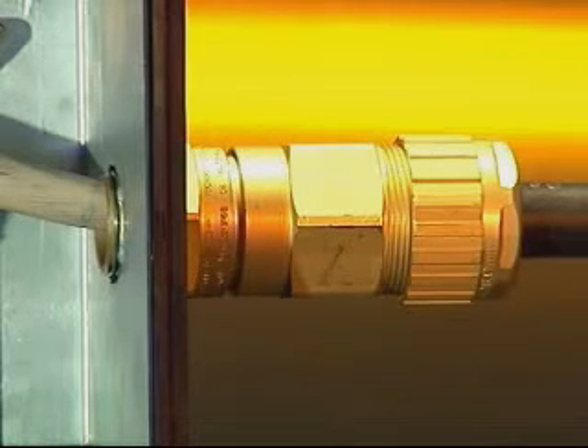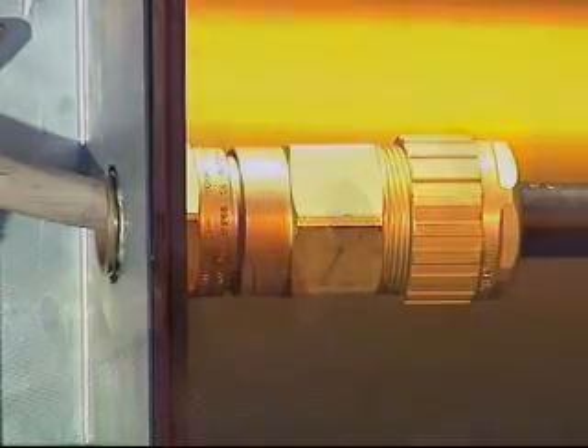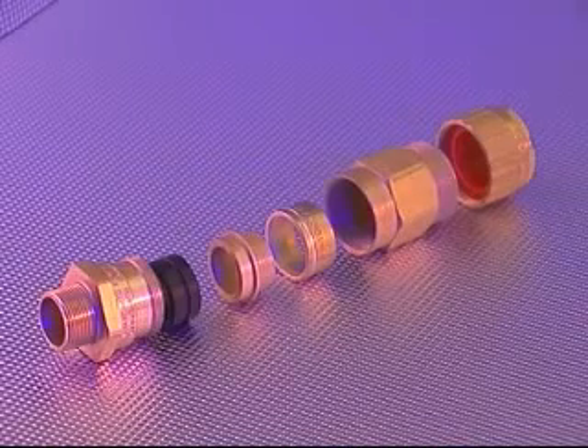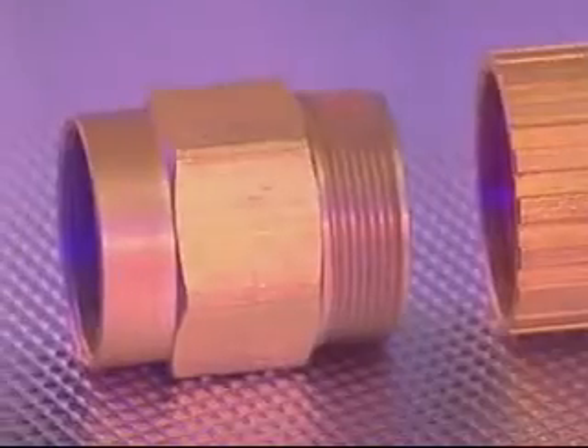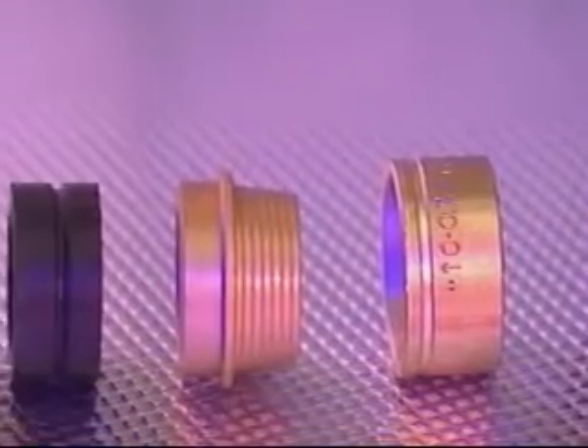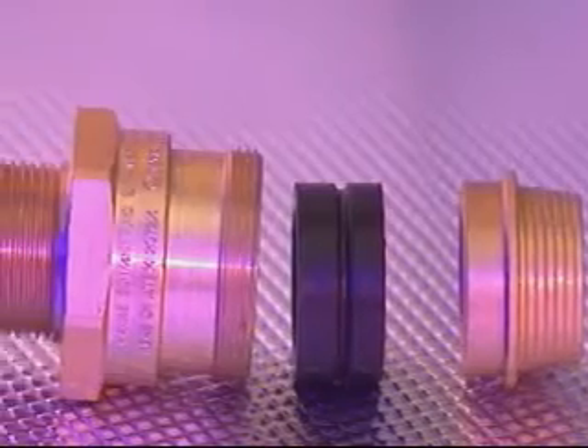The 501453 RAC and 501453 dedicated cable gland: general description. The 501453 RAC comprises six major components: the back nut, middle nut, reversible armor clamping ring (RAC), armor spigot, inner seal, and the entry component.